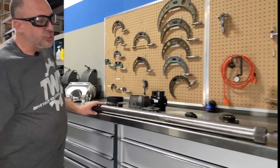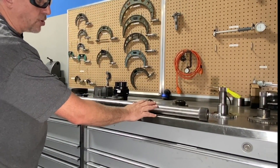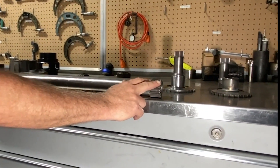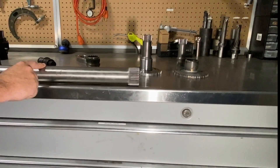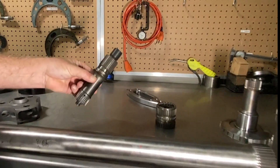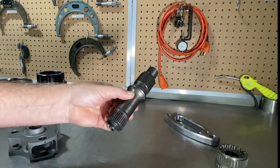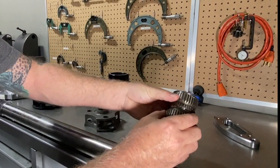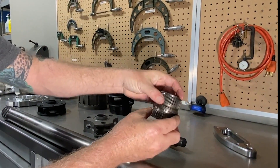The Integrexes are great for splining shafts and doing shaft work. This is one of the large trophy truck axles we manufacture — we're able to turn the part and spline the part in one operation. This spline is 100% concentric to the shaft because it never left the spindle. Here's a double spline shaft that we do — this has been heat treated. The splining can be phased, we have oil ports that can be drilled and intersected and threaded. We can phase mill patterns in with splines to keep a consistent orientation of a spline to a certain feature on the product.